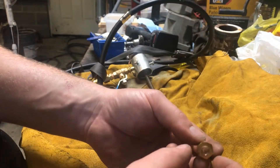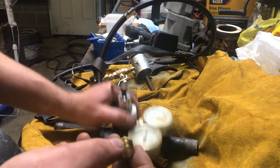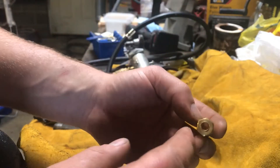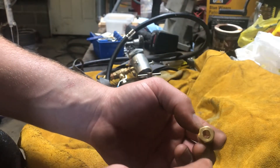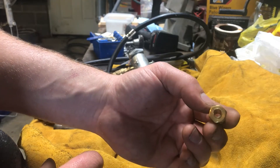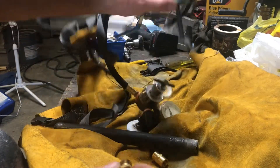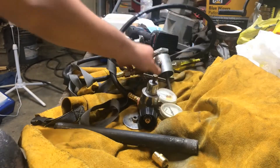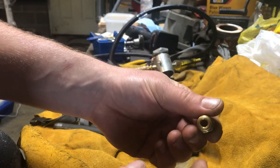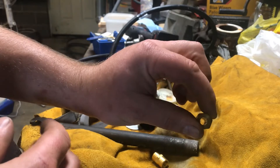With all my plugs, I drill and tap to whatever size I need. The MIG welding tip is an M6. But if you try to center punch the outside and drill it from the flat back end, it's usually really hard to get a centered hole. If you don't have your nozzle centered directly down your pipe, it won't burn very well. The best way to fix that is to drill from the inside with a drill press — it centers itself, and you can easily tap it, no problem.